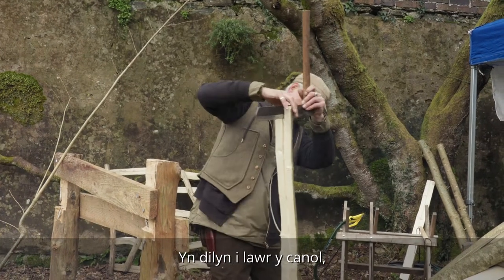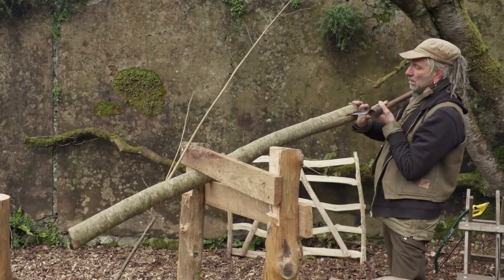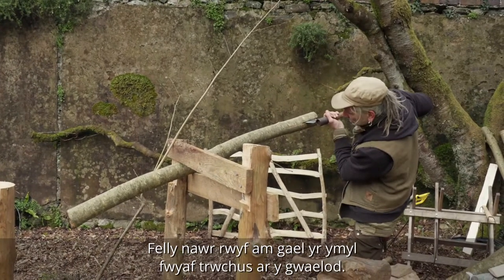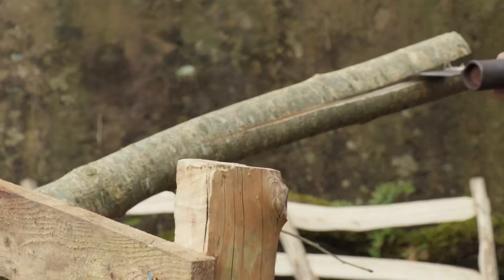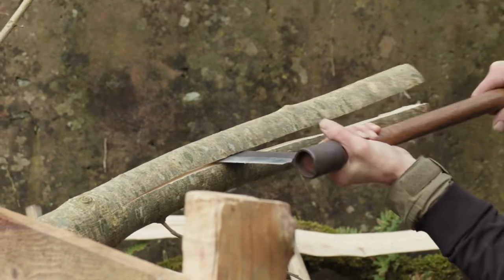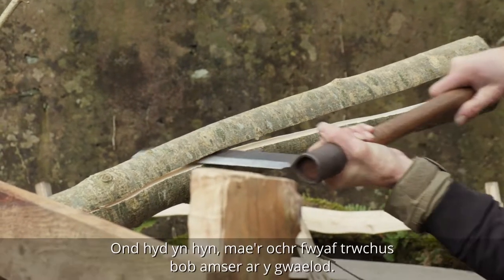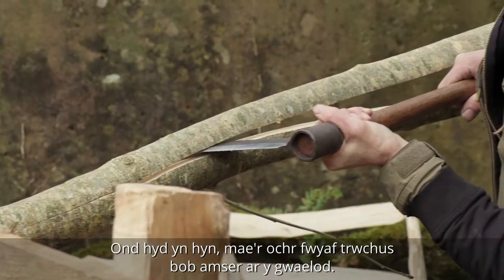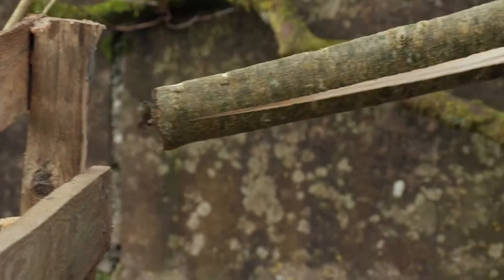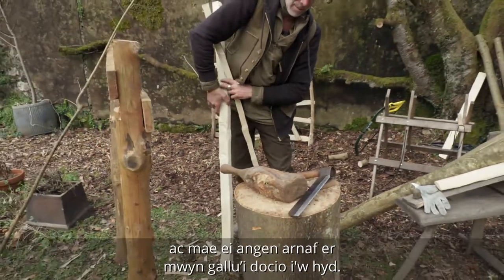Following down the middle, we can use the cleaving brake. I'm going to force it in — the thicker side points downwards. If it starts to run the other way I'll flip it over, but so far the thicker side's always on the bottom. And there we go — slight run-out at the bottom there, but luckily it's longer than I need so I can trim it to length.